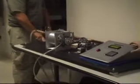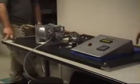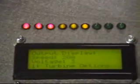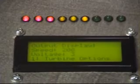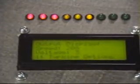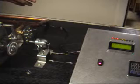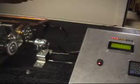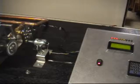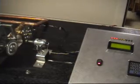So we have an output display option that measures the voltage and gives a proportional reading on our LEDs here. So right now we're spinning at about 208 RPMs and we're generating about 3 volts. And it's 208 at the shaft, so that's around 600 RPMs at the generator. Should we get 5 volts, then all the lights will come on, will flash, and we'll get a buzzer that alarms us we've reached our desired output.